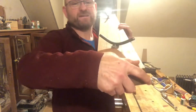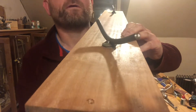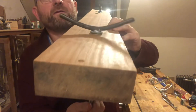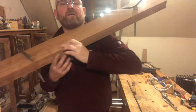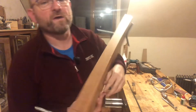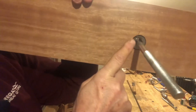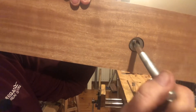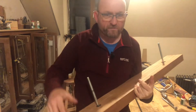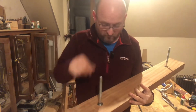This is what we end up with — this is the handle here. It goes all the way through and it twists really easy. There we have the tail too. On the inside I have a washer, and there's a little spot weld on the washer which stops this from going in and out. As I wind this, I want the jaw to come out and go back in — I don't want it pulling the timber. That's why I locked this carriage bolt in with the washer.